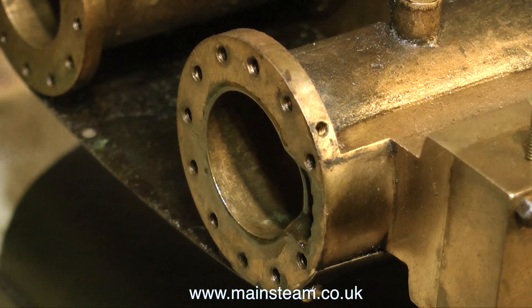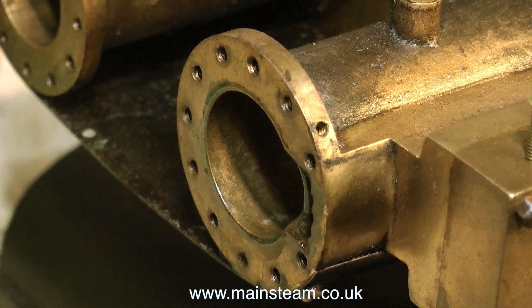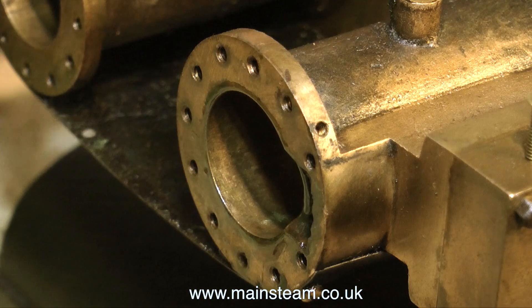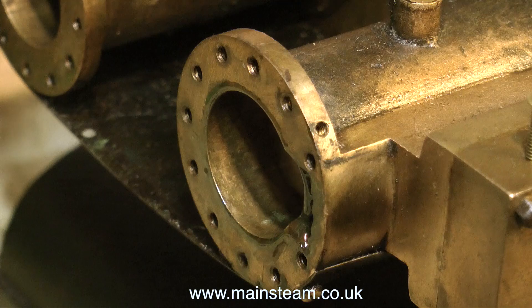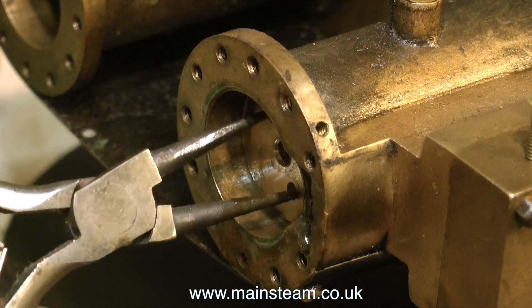This is still a little experimental because I am concerned about the hole from the top oilers in the middle of the cylinder. So what I'm going to do is run the engine for a while and see how it goes. If the piston seal gets worse, I'll have to rethink and possibly put liners in there. For the moment, it's looking encouraging. The actual piston has a much larger surface area in contact with the side of the cylinder — I will see what happens in due course.